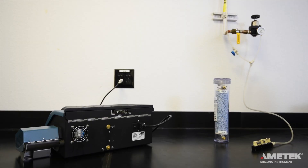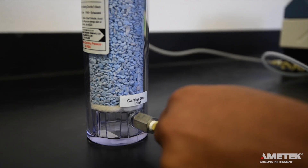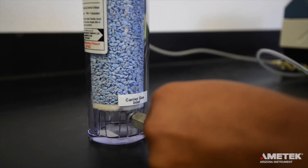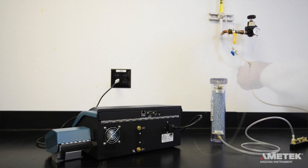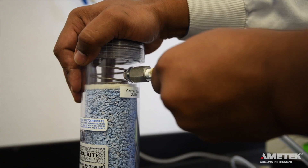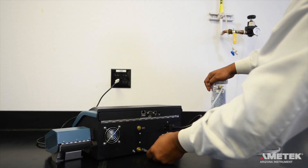With the instrument successfully plugged in but not turned on, it's time to either connect a dry air or nitrogen source along with the desiccator. This helps ensure that the gas is dry before it enters the flow system of the VaporPro XL. If the location is plumbed with nitrogen or compressed air, or if you plan on using a compressed gas cylinder, use the clear tubing from the accessory kit to connect the dry gas source to the carrier gas inlet port on the desiccator. Next, use a second piece of clear tubing to connect the carrier gas outlet port of the desiccator to the flow inlet port on the back of the instrument.